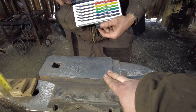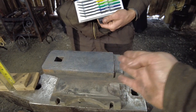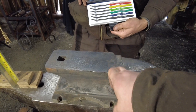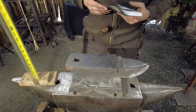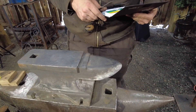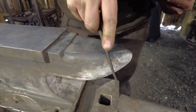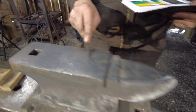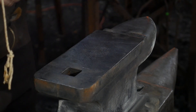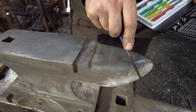We're going to test it over here on the horn first with 65 Rockwell. It bites right in - yeah, it bites really nice and hard. And now we're going to test it right across the face. It's biting - okay, it bites really good into the face. Let's move on to 60 Rockwell. We know the horn is soft, probably about 40 Rockwell - we didn't try to harden the horn. So let's just focus on the face. Yep, it bites right in, as you guys can see.